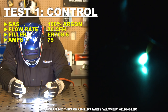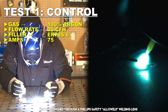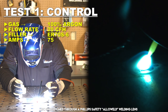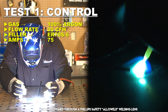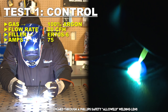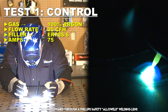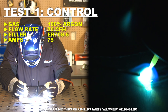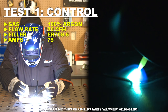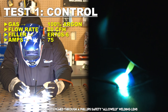I've got about 15 to 20 CFH of argon flowing, and all I'm going to do is get a puddle going — you can see the puddle started. This is just mild steel, so it's pretty inexpensive and pretty easy to weld. The argon shields it very nicely, and I can just dab and go all day long. I'm welding at about 75 amps.